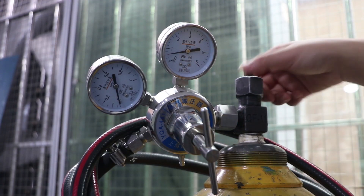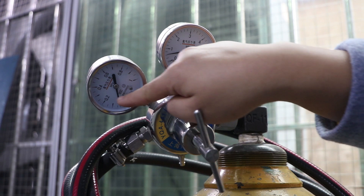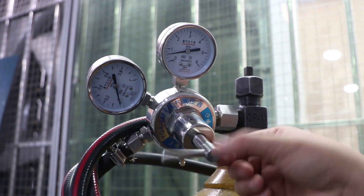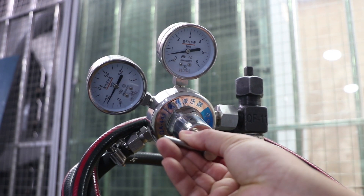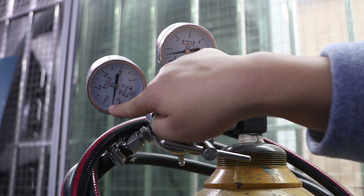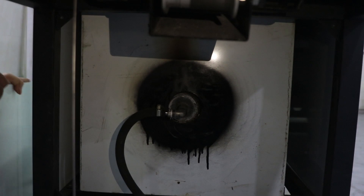This is the ammonia. First, you open the switch. When you see the ammonia is flowing inside, you need to regulate this one. Normally, we need to set to 0.15. After you set 0.15, this one is fine. The first time, you need to connect the ammonia — open the four screws up here, take this one out, and then connect the ammonia here.